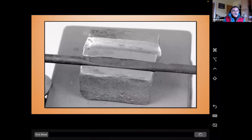So giving yourself, let's say, 1 inch, 1.25 inches from the end of the bar, hold it in the bottom swage, whatever you're using, and just flatten it for about the width of your hammer. What I want you to see here is that I'm not creating shoulders here. I'm just feathering this out to parent stock, and that's important to me. And I'm doing that on both ends, but certainly on the end nearest the end.